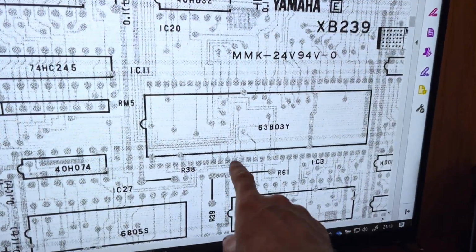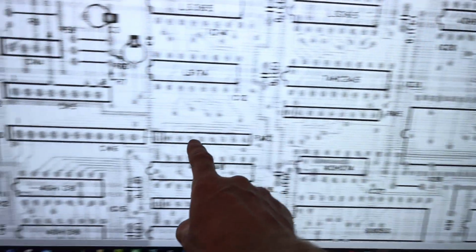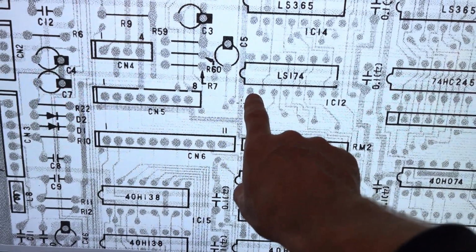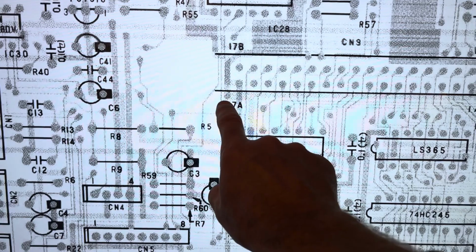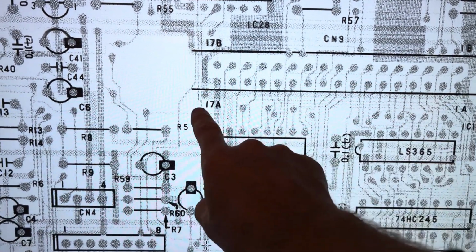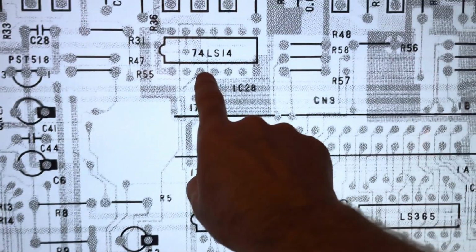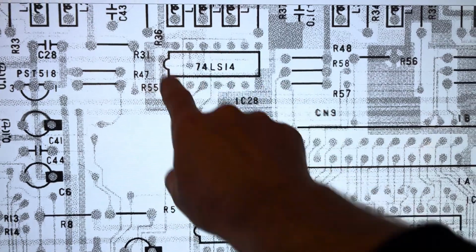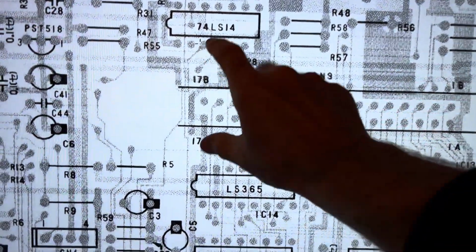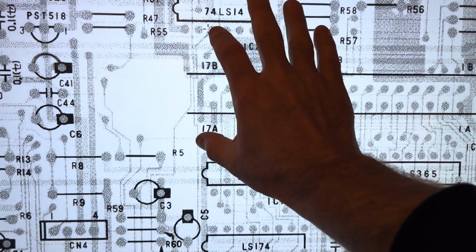So I've just traced on the board using a multimeter then pin 12, which comes all over here, pops out of the board just near leg 1 of this one, and then goes up, does a little detour around this, that's the slot for the cartridge or connector for the cartridge, another little turn into pin 3 of this Schmitt trigger assembly here, right? And that from there to there is a dry joint. So I think that's what's causing the problem.